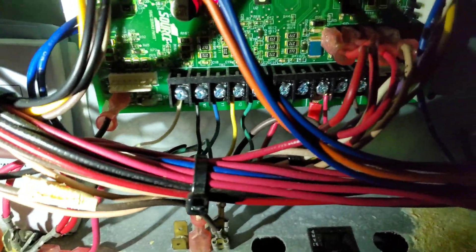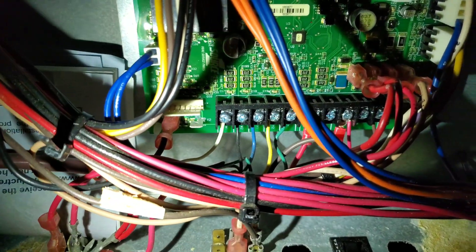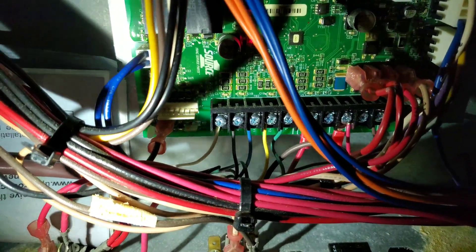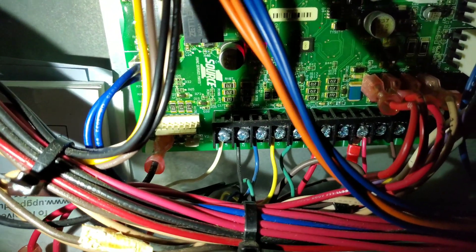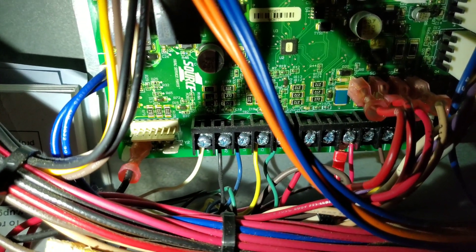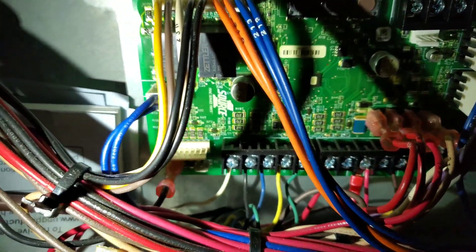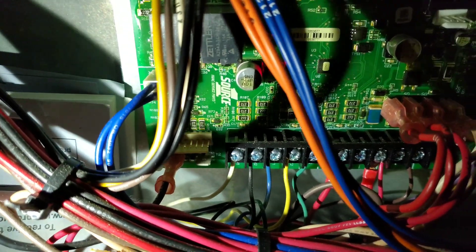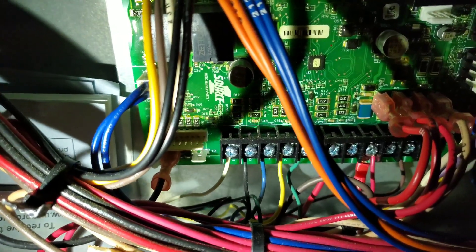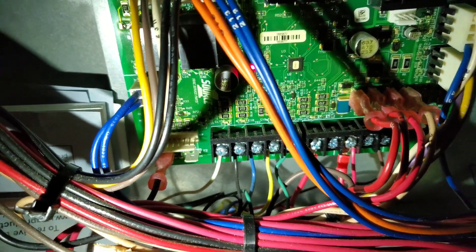W1 and R are back on. The heat's running. Down at the thermostat, I pulled the thermostat off the subbase, pulled the white and red wire off the subbase, and jumped them out with a jumper. I didn't make a video down there because it's a kids' dance studio. The thermostat has been bypassed and the problem has gone away. Through process of elimination, we've found the problem. This is the best way to troubleshoot a low voltage short — you're eliminating each thing as you go, and when you find it, you find it. Happy HVACing.